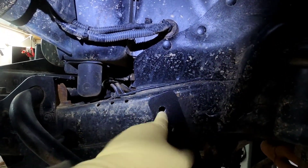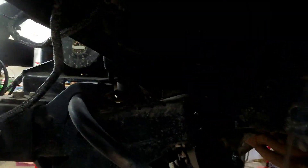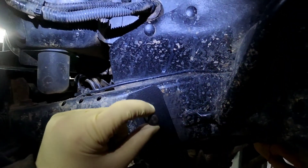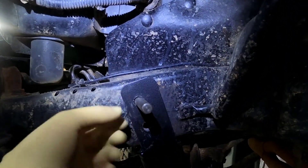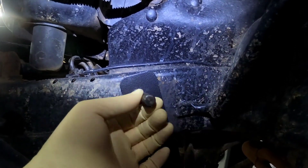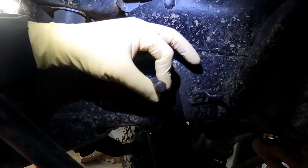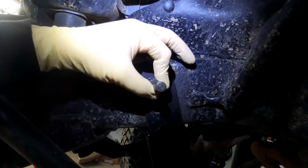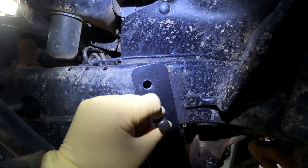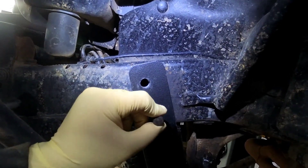If you put your drill in this way or that way a little bit off, it's gonna make it not go in the right spot. What I do is take this punch again and stick it in there. You're still gonna have wiggle room, so you gotta wiggle around, watch where it goes, and then average the hole in the middle, give it a whack. Then down here on the other side, you gotta look up, down, left, right and pick the middle.